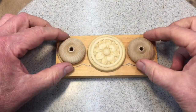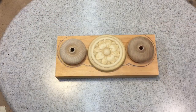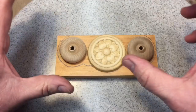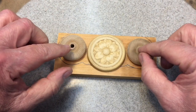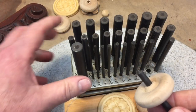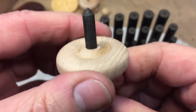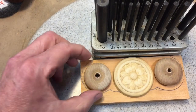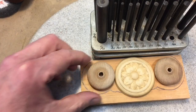Okay, this is what I'm looking at. What I want to do is recess these — these are toy wheels — recess them in there. So I'm going to use a spade bit to make a hole, a little hole to recess them a little bit to make it look like one piece. To make that hole directly in the middle, I'm going to use what's called a transfer punch. This is a transfer punch set — comes in handy when you need it. It transfers the center of that hole. It's got a little nib on the front, so you put it down, and when you have it set, give it a little tap and that'll make the perfect hole right where we want it.